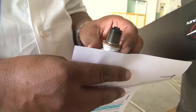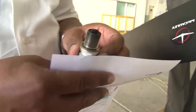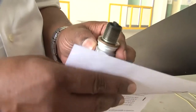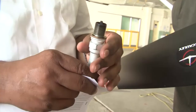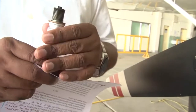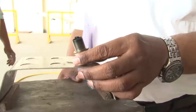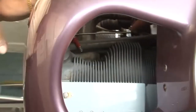Now, since we have removed the spark plugs, as part of our inspection, we will also clean the spark plugs, which you will see in our next video. This spark plug, cylinder number one top, we will place in the tray meant for this purpose, and this will be placed back in the cylinder number one top position. So now the spark plug has been removed, and we will bring cylinder number one to the compression stroke.